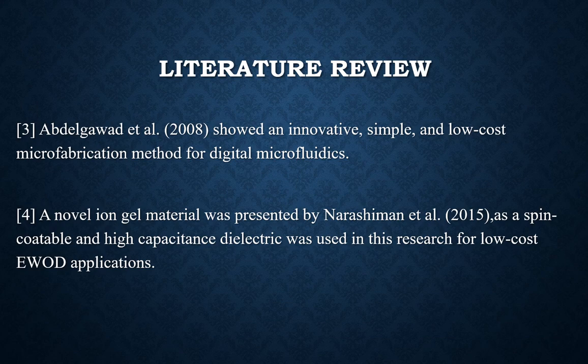In this article, devices are created from copper substrates or gold compact discs using rapid marker masking to replace the photolithography approach. Besides that, Saran TM wrap, polyethylene film and commercial water repellents were applied to replace frequently used and more costly materials such as Parylene C and Teflon AF for dielectric and hydrophobic coatings.